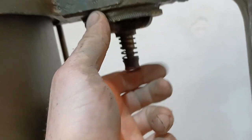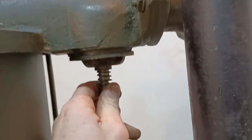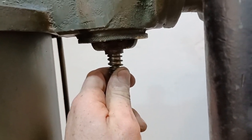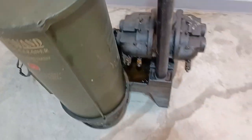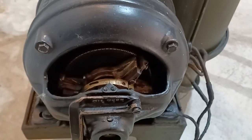This is a relief valve, which will be set for, I believe, four inches of mercury. This relief valve is needed because the blower is positive displacement, and if you don't have it, the blower will in fact continue to try and move air until the motor literally stalls out. I have it connected up here, so let's fire it up — we're going to watch the motor start.